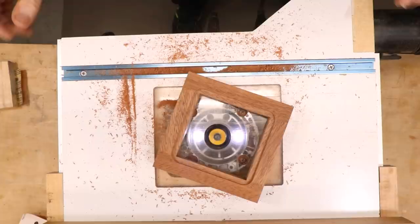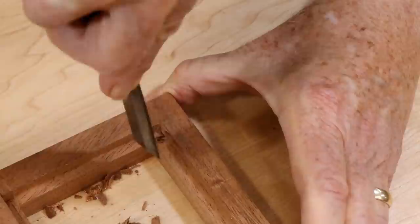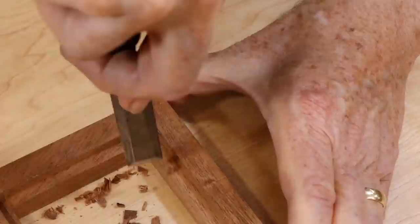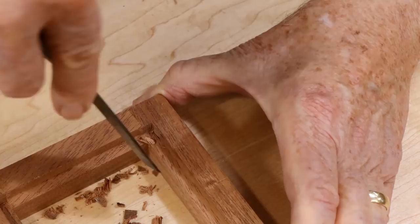Cutting rabbets is easy work with a rabbeting bit in my router. The workpiece presses against a bearing on the bit, which maintains a uniform recess and eliminates the need to set up a fence. However, it leaves round corners. Those can be squared up with a chisel. If the chisel is sharp, you can just shave off thin layers until you have cleaned out the whole corner.